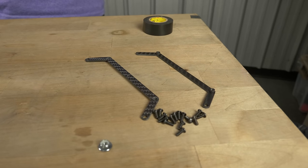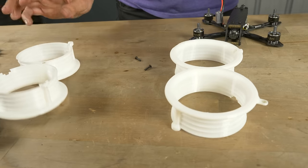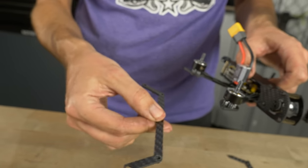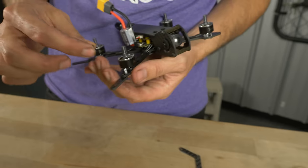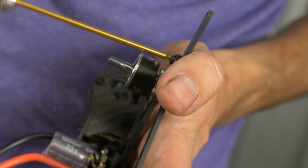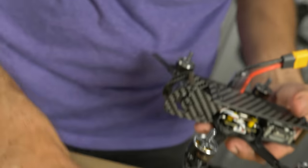Here's everything we need — the duct mounting pieces and screws. The ducts themselves must be purchased separately; a duct kit comes with two ducts and two longer screws. Take the duct mounting pieces, flip them so the press nuts face downward, then line the pieces up under the arms. Drop screws through the holes in the tip of the arm, get both finger tight to line everything up, then crank them down. Repeat for the other side.